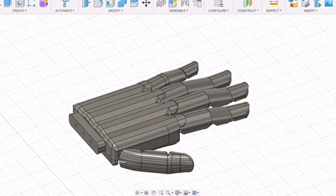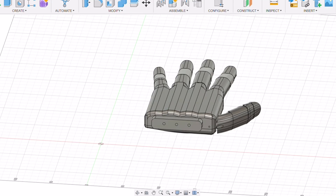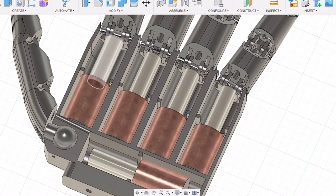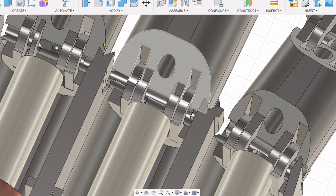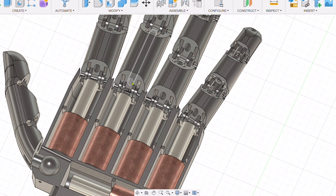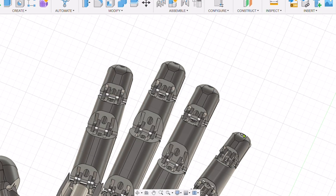Here is the design we're starting with — I've copied my left hand, shaped it pretty well. The fingers splay out a little when extended but should make a fist when closing. There are three holes at the bottom to attach onto a forearm piece to be made later. Rotating around and removing the cover, you can see five solenoids — five coils of copper wire and rods — each in place to operate the thumb and four fingers. Wire will be attached to the ends of those rods and pushed through holes running through the fingers, all the way to the fingertips, so when the rod is magnetized and pulled into the coil it will pull the fingers closed. For now I'll use string, as it should run smoothly through those holes without snagging, held in place with bolts at the top of the fingers.